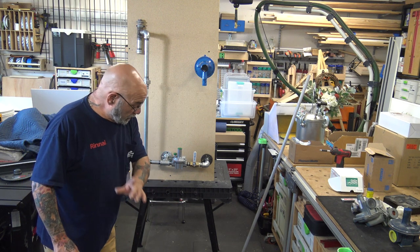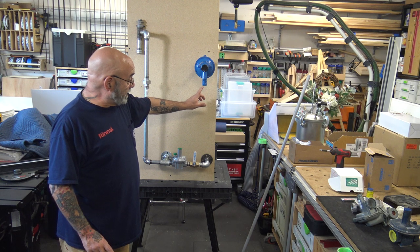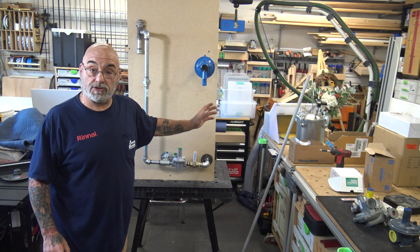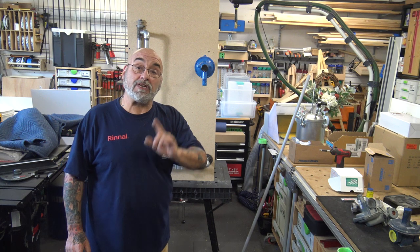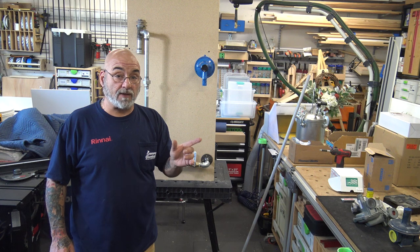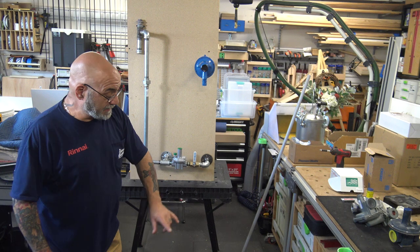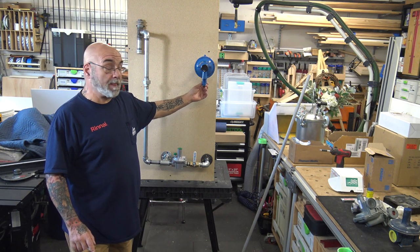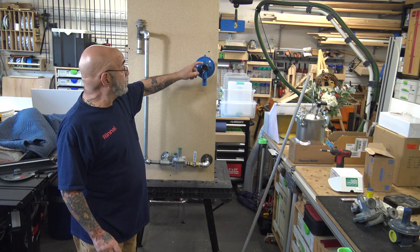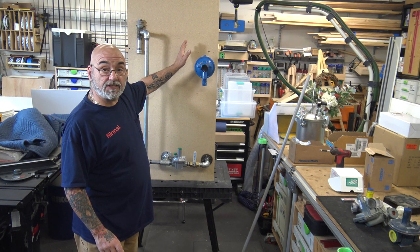Why? Because we would be bringing a gas line under the ground with a valve here up into this regulator, and it's 1/2 inch, it would be 10 pounds. Now, you can't put 10 pounds or 5 pounds in a house. Here in Florida, you can do 5 pounds commercial, but other than that, it's 2 pounds inside the house. So it would be 10 pounds feeding the regulator, then we would reduce it, say, to 2 pounds, which this regulator is, and then into the house to, say, the other side of the house to the tankless.